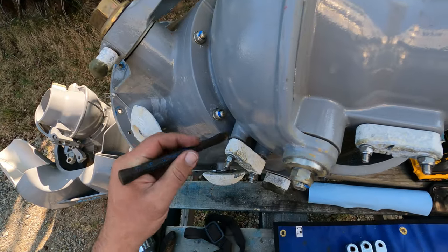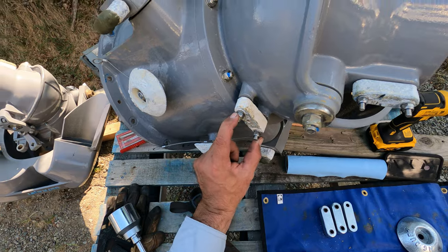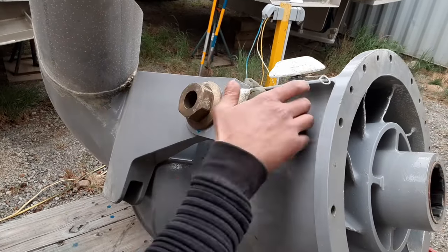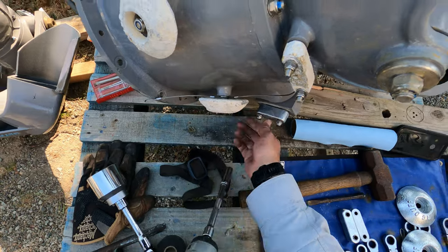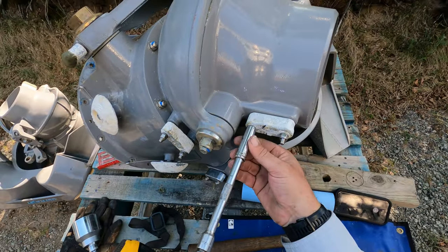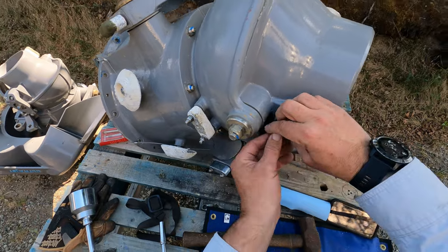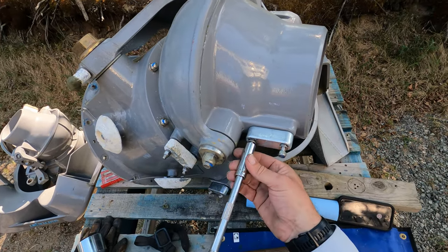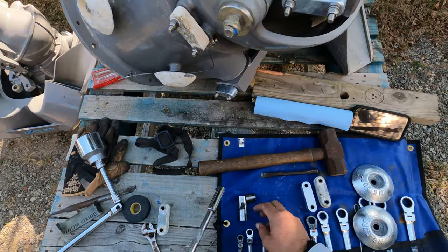Look at this — it's pitted something terribly. And of course, what we always do is put this splash zone on here to cover up the studs so the web doesn't catch on them, and on the bottom of that pivot pin as well. I had one of the deckhands take off some of those other ones. That's how easy it is to change out one of those. We've got several to do here. It's better to have more surface area, fresher zinc, than have it start corroding into your high-dollar unit here.